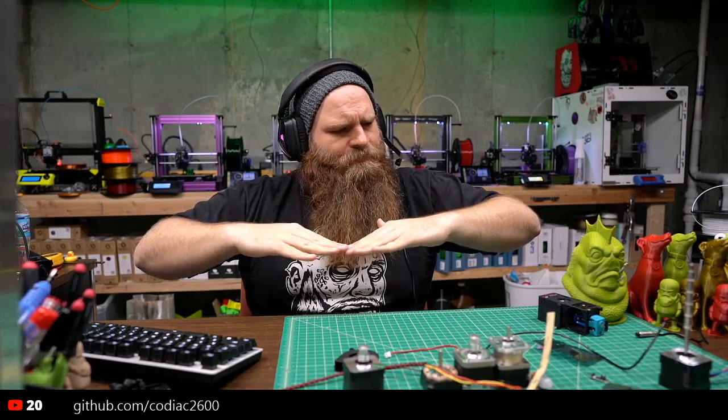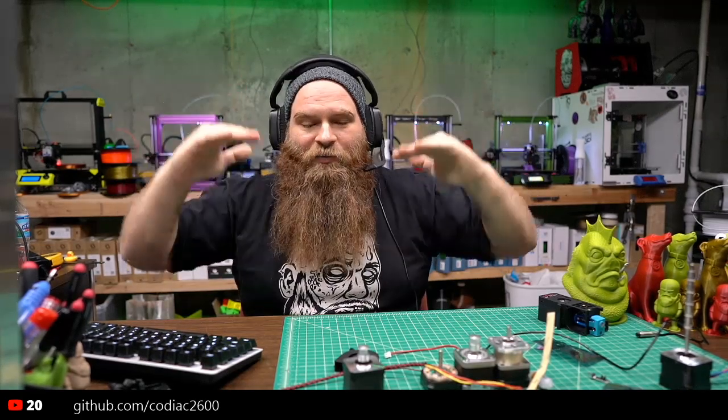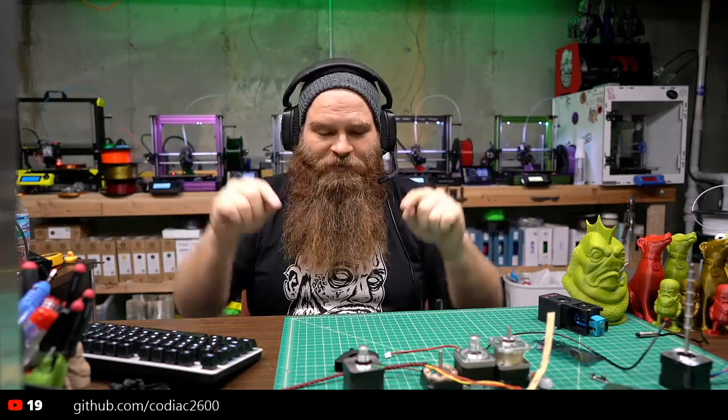When you own a Prusa, Prusa uses sensorless homing for what's called, I think, just Z calibration. What it does is keep raising the Z axis until it hits the ends at the top and rams into the top until it's level. Now, the issue with that logic is that your Z-toppers are supposedly in line with your bed, and they're usually not. It's taking into account a lot of factors: that your printed parts, your Z-axis ends, or your X-axis ends, are perfectly level, that the prints of the Z-tops are perfectly level and screwed in perfectly level, and everything hits. And then it's trying to take into account that all that is level to the bed.